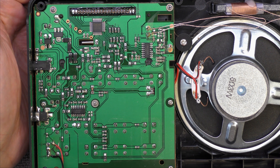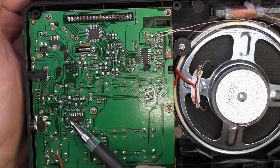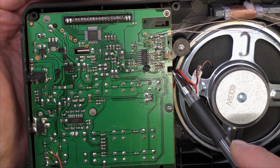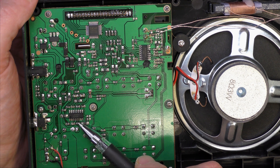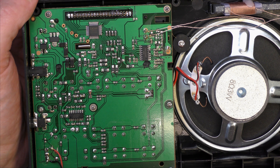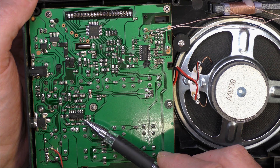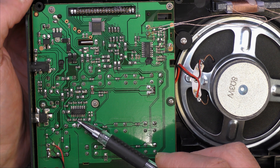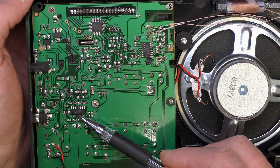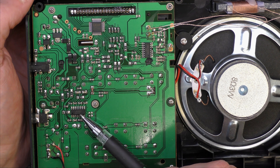There are a few diodes here — I wonder if they're used to steer the voltages from the battery. Near the AC input jack, the speaker lead goes up to this chip here — this is an LM4863, which is a dual bridge amplifier. But it can also drive headphones single-endedly from the same amplifier by automatically switching over. So that drives stereo headphones — hence the stereo FM — and can also drive a speaker. At eight ohms with four and a half volts that's about a watt.